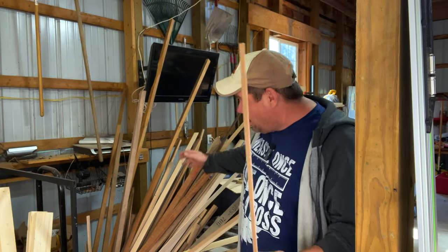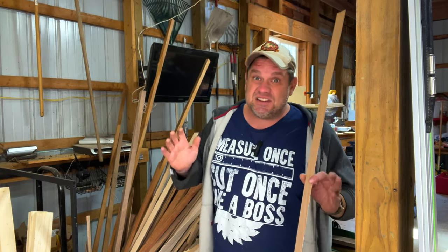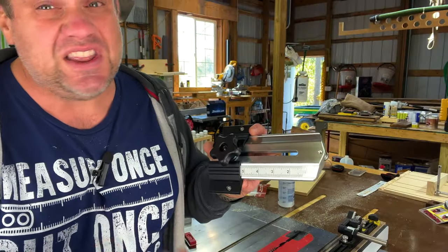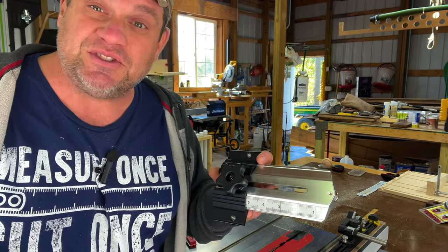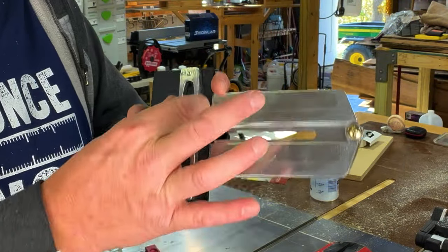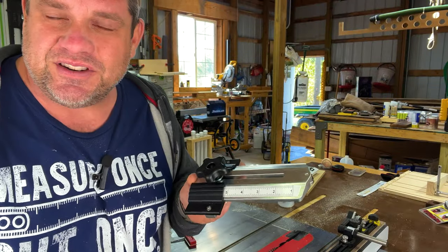I have a bunch of cutoffs here that are thin strips, but none of them are the exact same width along the entire length of the strip. And that's what this next jig is all about — let's take a look at it. This is the Fulton thin strip jig. This thing was created so you can make a lot of repetitive thin strips on your table saw without having to make a lot of adjustments. It fits right into your miter slot as it's got a bar on the back. If we look at the very tip, it's got a bearing that your workpieces rest against so you can easily slide them through your table saw.